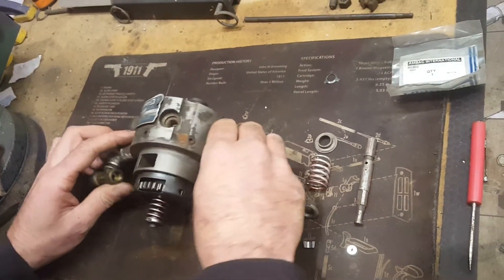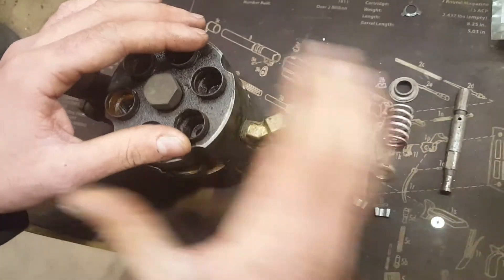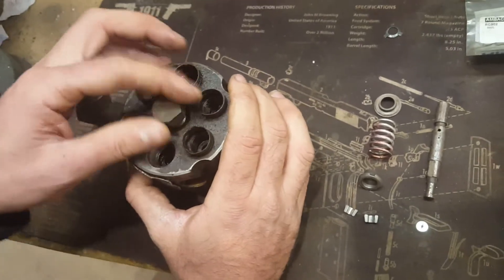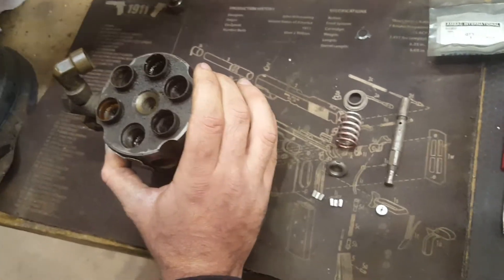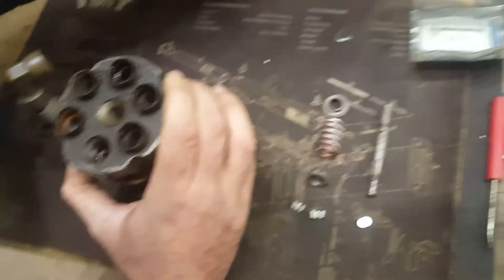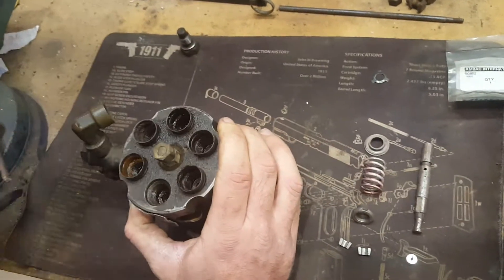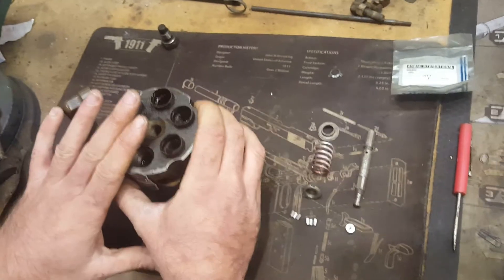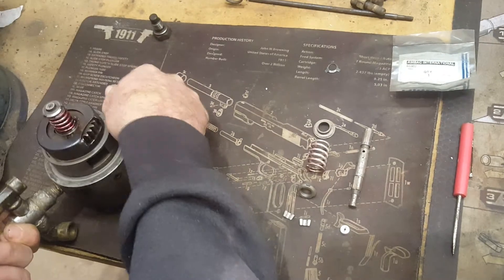You'll want to remove your center bolt, which is what the three-quarter wrench or ratchet and socket is for. The reason you want to do this is because you need to insert something in it to keep the plunger from moving when you're trying to take the valve spring off. You can use a bolt of whatever length works for you — just drop it in so the plunger will hit it and not continue up when removing the spring.